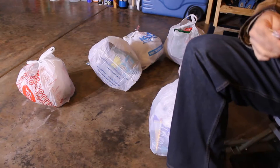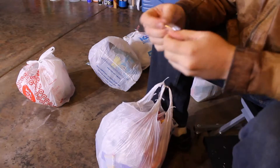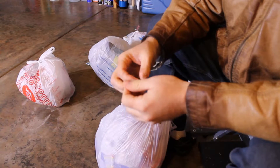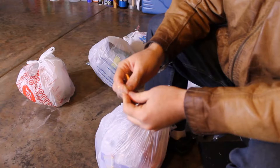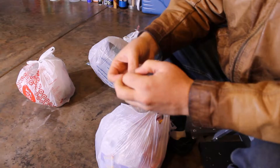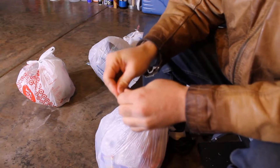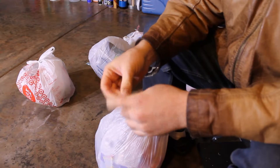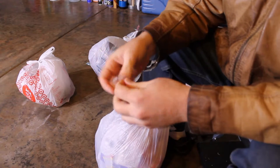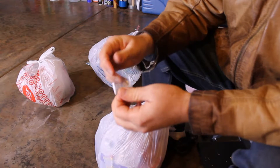KettleBow CNC vlog. One thing I discovered when sorting through all this polypropylene was a little piece that says code 01 PET. I threw it in with the PET, but I noticed some interesting properties: it's quite flexible, it crinkles a little bit like polypropylene, and it fails the tear test like polypropylene. But it is a little bit more bendable and flexible without being quite so crinkly and stiff, and of course it's polished — shiny and waxy like polypropylene.